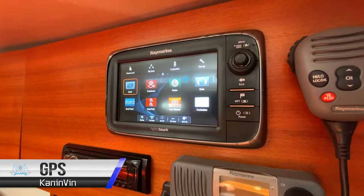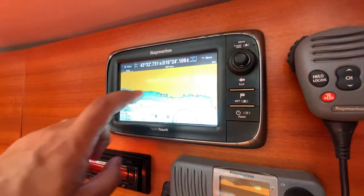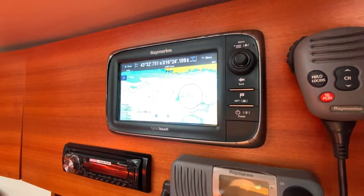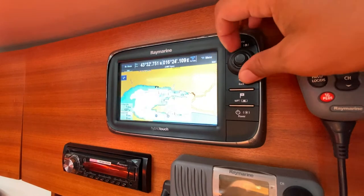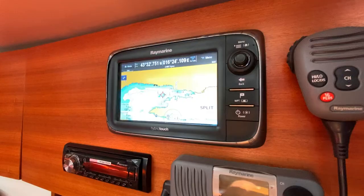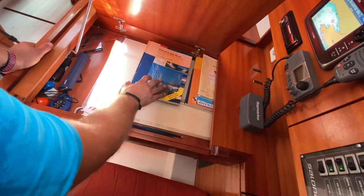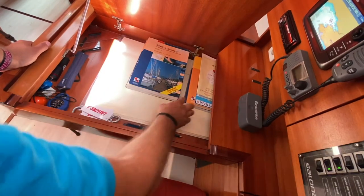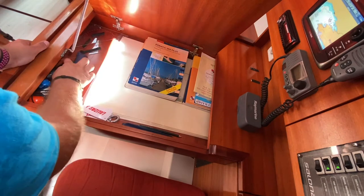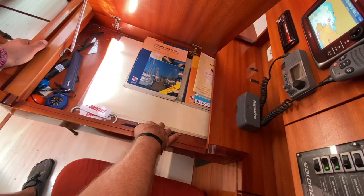Your Raymarine GPS is located here at the nav station. You can use the different options or press chart for the navigation chart — this is a touch screen system that allows you to pan and select detail on the chart. To zoom, use the wheel. You also have two more displays located above the companionway in the cockpit. Inside your chart table you have the Adriatic Sea Pilot, light lists, and cruising guides for the area, as well as manuals for the yacht and charts for the area you are cruising in. You also have plotting equipment, a flashlight, keys for the yacht, a hand-bearing compass, spare shackles, and dividers for navigating.